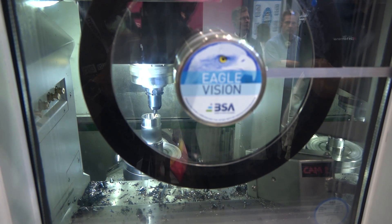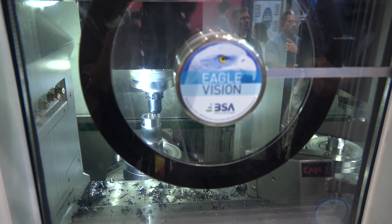So I get really excited about this machine. You have two independent heads, two independent 5-axis tables, giving the options for two OP10s, OP10, OP20, because we can transfer between each spindle.